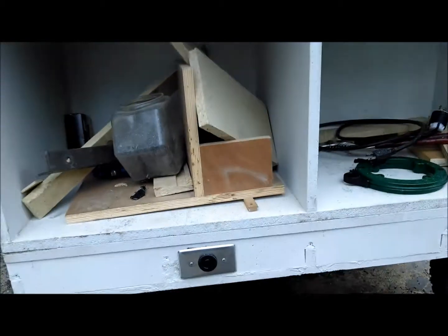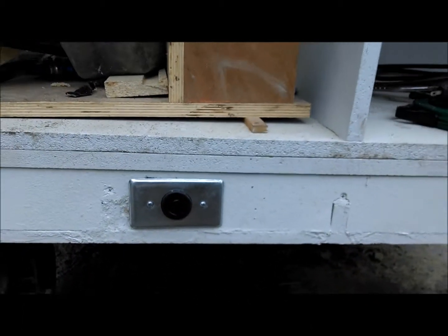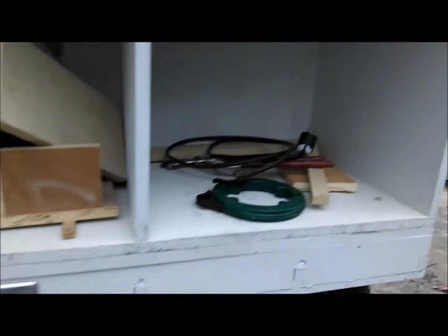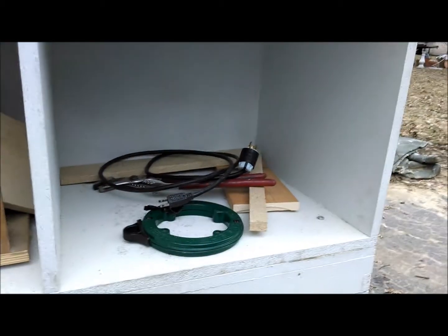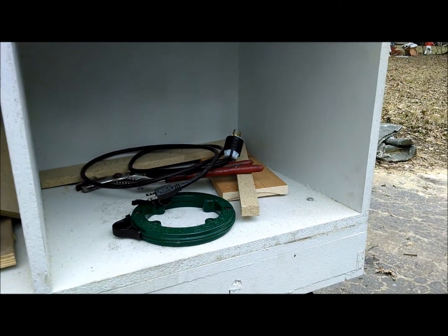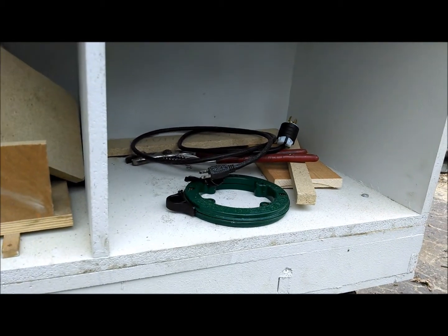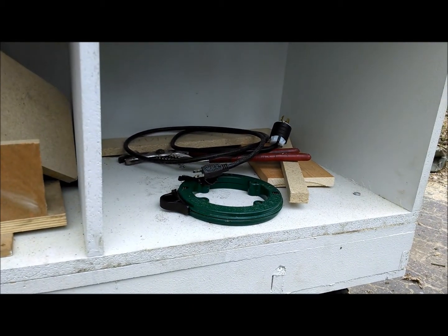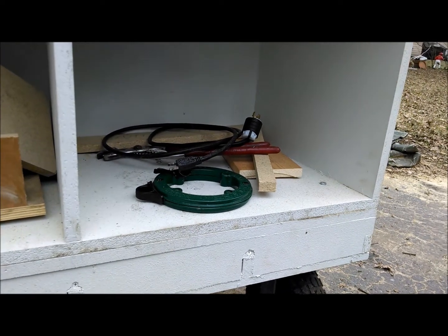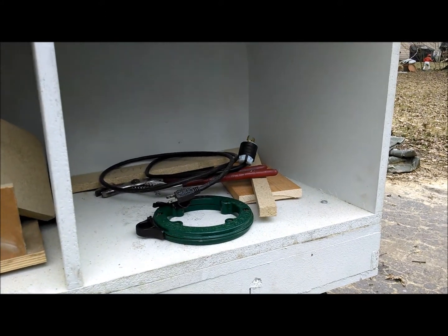We've got more storage here. The main outlet is in — a twist lock outlet so that as you plug it in, you've got to twist it, and that way you'll ensure that it won't fall out and you'll lose power and wonder why. There's the cord that I've made so far. I was going to use an old extension cord that I had, but unfortunately that cord was so bad somewhere inside of it that all I had to do was touch it to some wires that were plugged into the outlet for a charger and it would pop the GFI. I wasn't even plugging it in — I was just bringing it near the other outlet and that would pop it, so I wasn't going to use that.